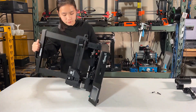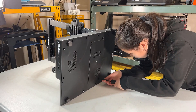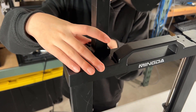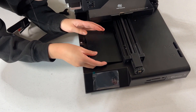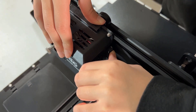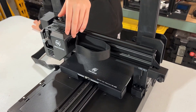Flip it over, tighten the longer screw at the bottom, and do the same to both sides. To install the filament holder, you don't need any screws — just snap it on top of the printer. Put on the drawer cover, and we can now connect some cables. The single ribbon cable will connect the hotend, thermistor, bed leveling sensor, and all the fans inside.